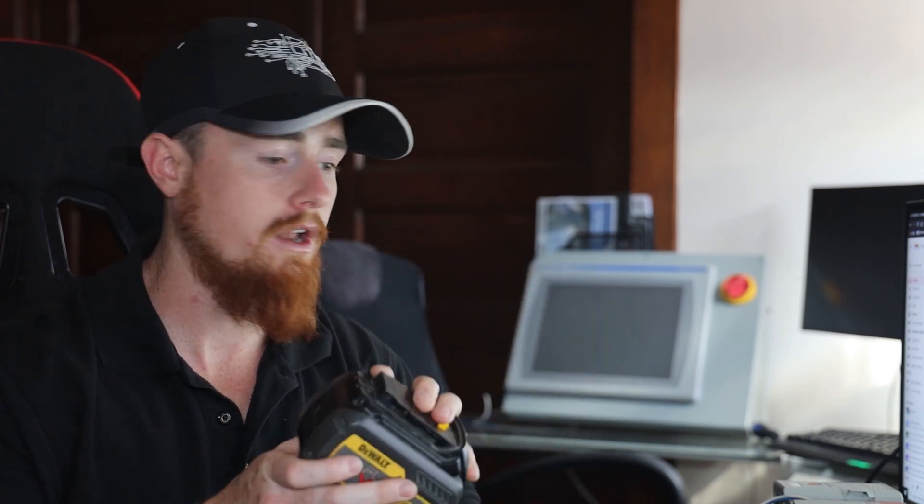You're not going to have to worry about this thing catching on fire. I've ran entire main enclosures off of these — maybe we have the high-voltage side killed or not even landed yet for safety purposes — and we're running the whole cabinet off of one of these power supplies. That way we can still close the doors and not have any cables running up the front of the door to plug the 24-volt power supply into a 120-volt cable.